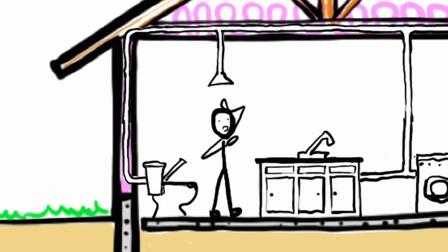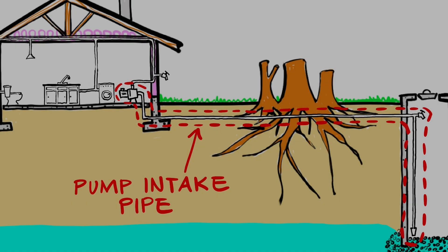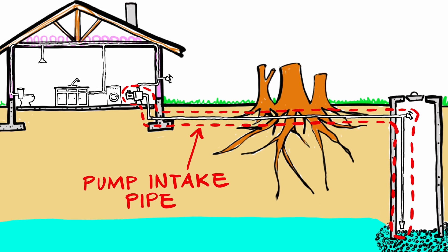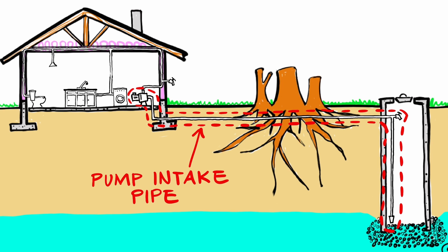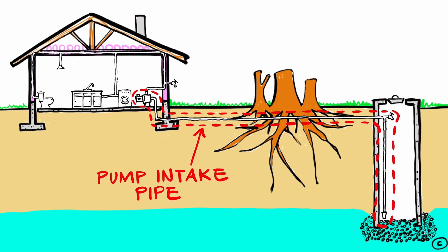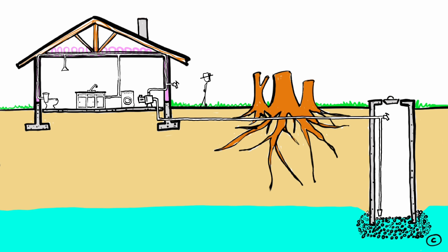When this happens, it is no fun to be in a shower. Eventually the water level will recover, but for us to have water again, I must fill the whole section of pipe from the pump to the well with water. But even if we don't suck the well dry, we still don't have enough water from the ground. And I don't need the hassle of hauling city water each summer. So I will install a water storage tank to get us through the drying months by storing water earlier in the season.